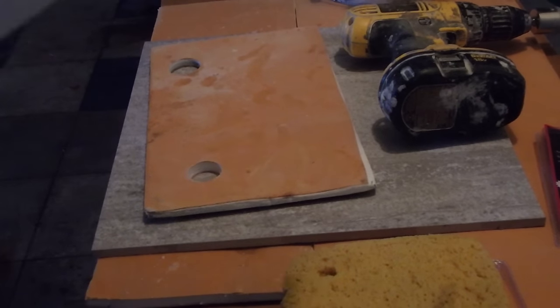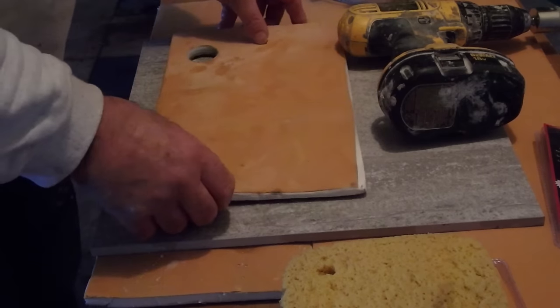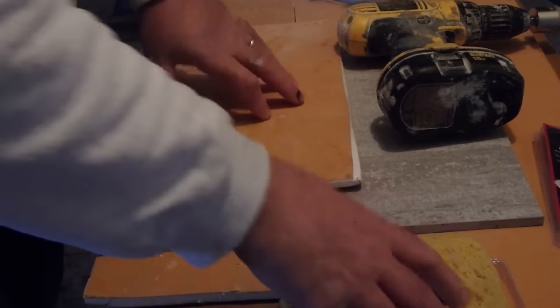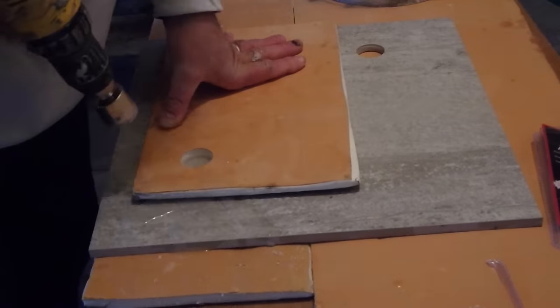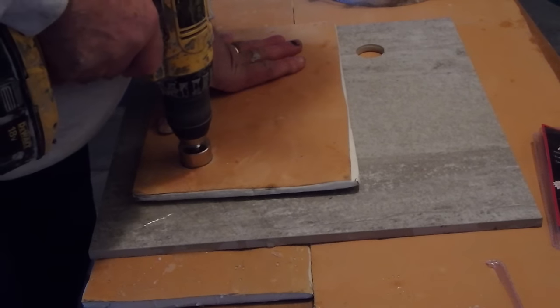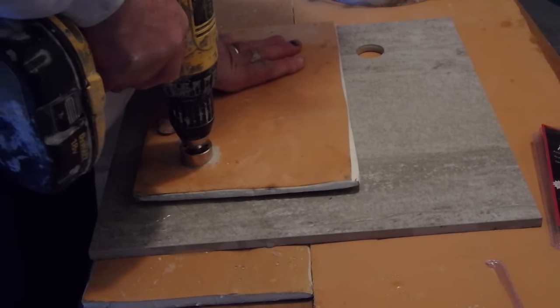Another way of doing it - this is the way I usually do it. You mark your tile, usually with a square, and then you get a piece of board here. This is a foam board, or a piece of plywood - a small piece of plywood or whatever. But I like the foam board. You put it in place over where it's got to go. Now that makes like a little reservoir, and also it holds the drill in place. So when you start, it just goes right down and then you start drilling.